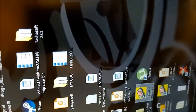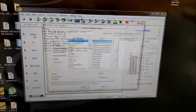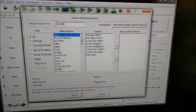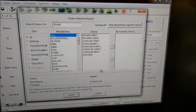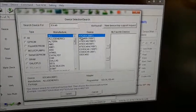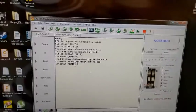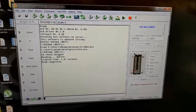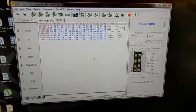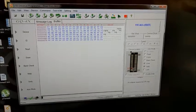Load the program — it's called Launch USB program. Click on Device and it'll pop up asking what kind of chip you have. Read the chip's fine print — this one's a 93C46. It's an 8-bit chip. If you do 16-bit and when you're reading you get a bunch of empty lines — tops full but the bottoms are empty — it means it's an 8-bit. So click on 93C46, click Select, and now click Read to read the chip. In the buffer, if you get a lot of FFFF lines all the way down it means it didn't read the chip properly, but here it read correctly.